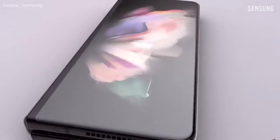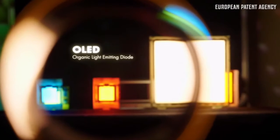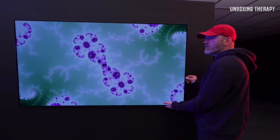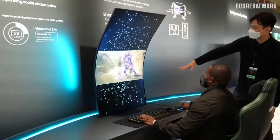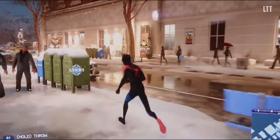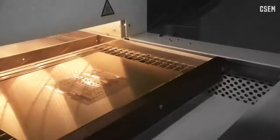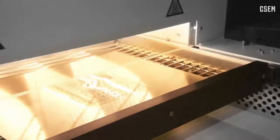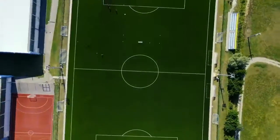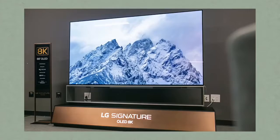The main real business around organic semiconductors are OLED organic diodes. And it's already super advanced because they are lightweight. You can make them large, bright and flexible. And using OLED for screens gives better color, much better light distribution than LCD displays, so liquid crystal displays. And since the substrate here can be anything organic, theoretically you can build really large screens of the size of a football field or even larger, and it's relatively cheap to fabricate.